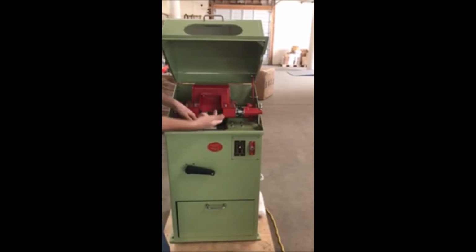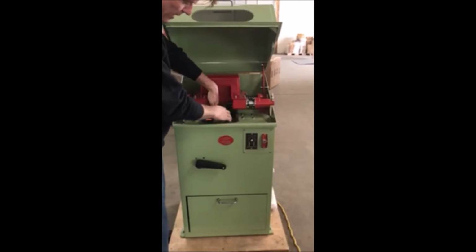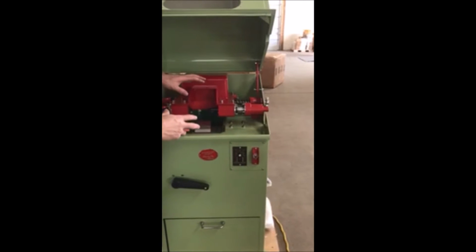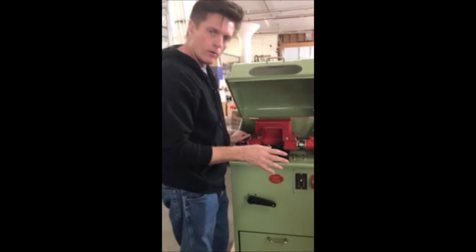and what that does is that keeps spray from coming in the front of your saw. So you can see that greatly reduces the spraying that will happen with the oil. So install those 2 pieces. The problem with your oil will go away.